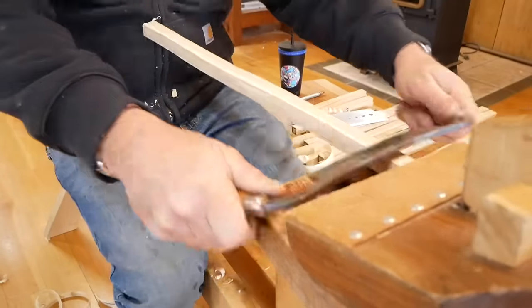The beauty of this is I don't have to set that for either side again. So now I'm going to put that right over the crosshatch of where I'm drilling there — I've got my 19 degrees this way, and level to the bench that way. I can feel it change; I thought it came out the bottom of the hole, and you just kind of melt down through that. There's some tear-out, but it's just the nature of the beast with this pine — it's on the bottom. Now each one of us drills our leg holes from the top through to the bottom. Greg described the sight line and the angle line from each one of the 90-degree intersecting laser lines, so we know the angle the leg is going to be at.